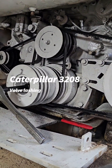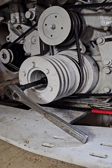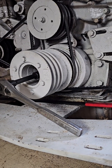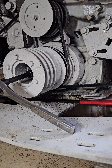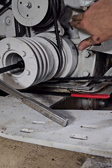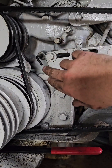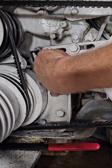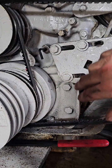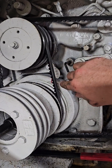Caterpillar 3208 valve lashing. Rotate engine clockwise as facing — the tech manual will state counterclockwise rear-facing. You can pull this bolt out and use it as a reference point; this is your timing bolt top dead center indicator. Remove mine — it was a flare fitting that I removed. Take it off and rotate the engine.